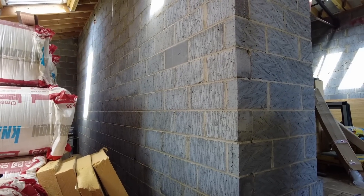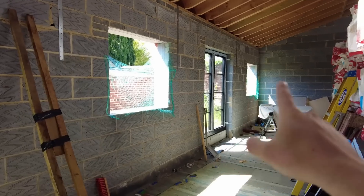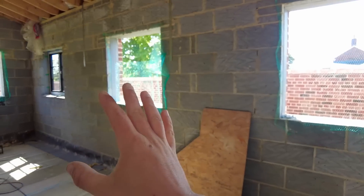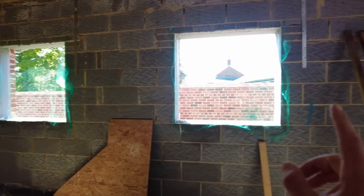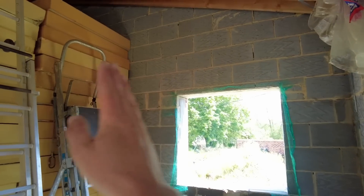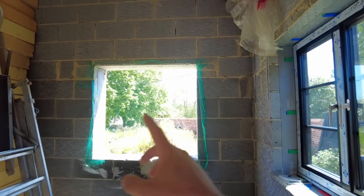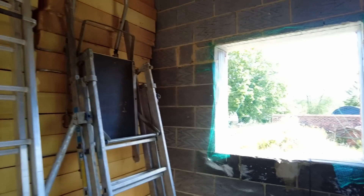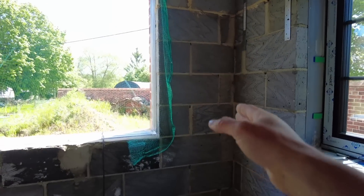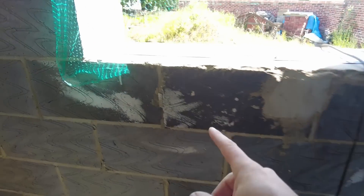What do you reckon — is it going to crack at some point? I'm going for wet plaster straight on it, which will be meshed. This 100mm block wall should theoretically have had three joints in it. The end wall is less than six metres side to side, but it's locked into this one and into the other one, so I don't think that counts — unless you've got expansion in the corner.